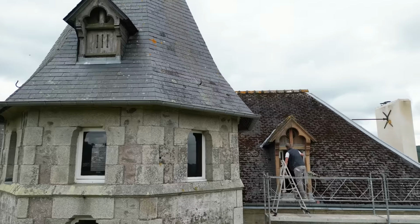So I've got all of the window mostly sanded now, which is looking brilliant. Just got a couple of little bits to get out with the grooves, which I've got a scraper for. But before I do that, I thought I may as well get some of the wood hardener on, just to fill in some of the gaps up there, and then that can go off and get set. And then while that's setting, I can go along and get all the little bits off.